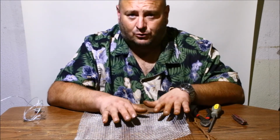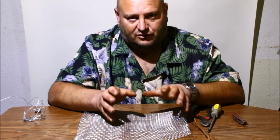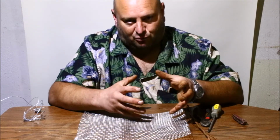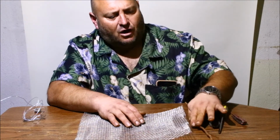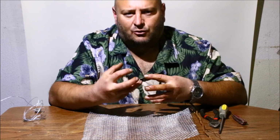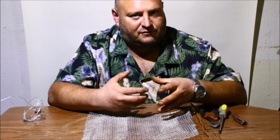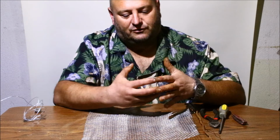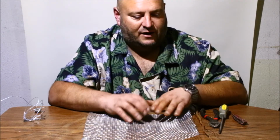You can use it on your home tools or whatever you may have that has rusted up. So this is not just geared towards metal detecting. It has other applications as well, where you can strip rust off of items. Another thing as well: the way electrolysis works is it actually strips away the rust and not necessarily the bare metal. I'm sure if you left it in there long enough, it may eat away at it, but you probably won't have that situation. Basically, it just attacks the rust, so you have no issues there.